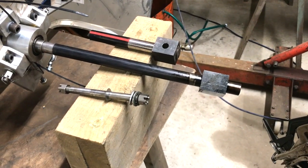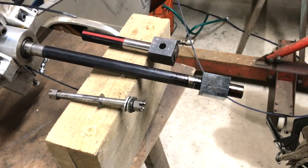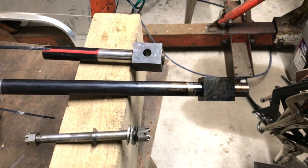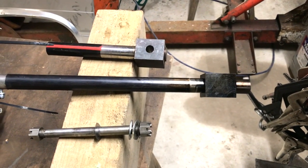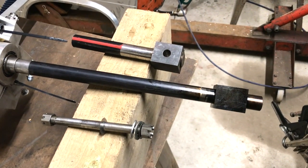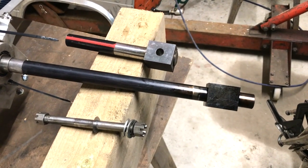That's cooled now. All that's left to do is drill the hole right through — it'll have to be drilled and reamed, nice and accurate. I'll do that in the milling machine and then press the pin into the hole.